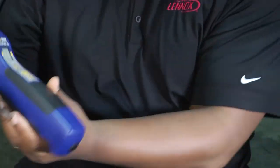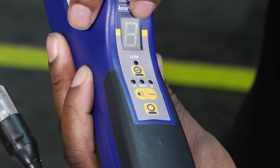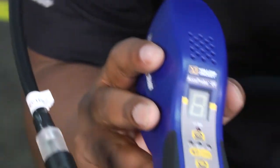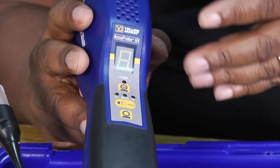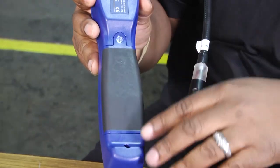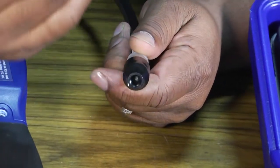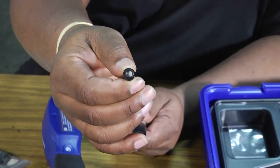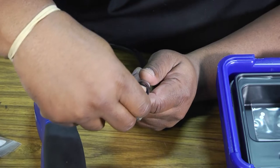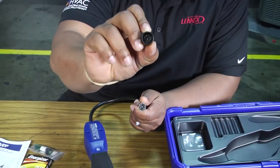When you look at the leak detector itself, you'll notice it has a high-normal and low-normal high sensitivity setting. This window is going to tell us the size of our leak in a range of one to nine — it doesn't specify what one to nine means exactly, just that it shows the size of the leak in that range. When you screw the tip off, that little white filter is on the inside of that tip, which is what you change out when replacing the filter. The sensor also has to line up with the little pins on the inside to fit together properly.